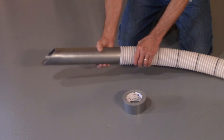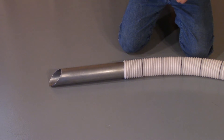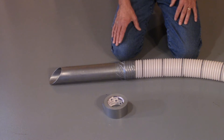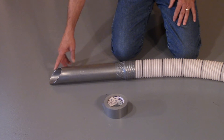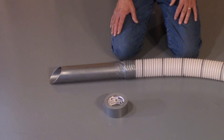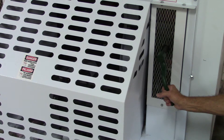Now we want to insert our steel hose tip into the end of the hose a few inches and tape it on. The reason we put the tip on is because it's made of steel and gives you weight so it's easy to slide down. Also, the angle makes it easier to get around vent stacks and things like that.